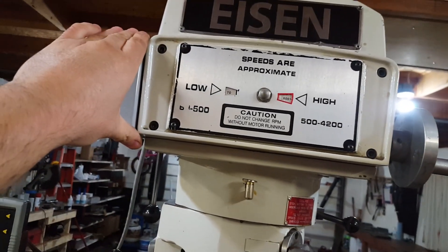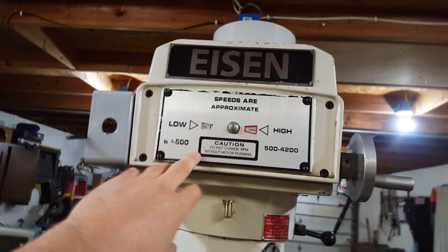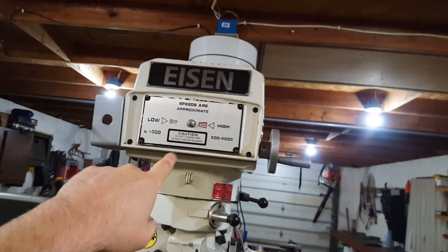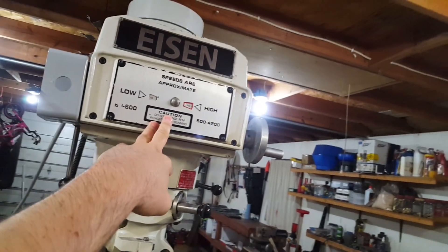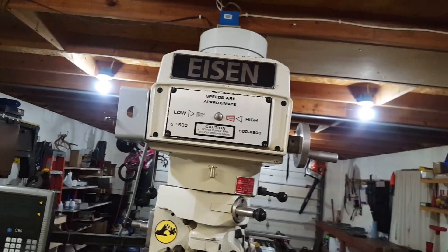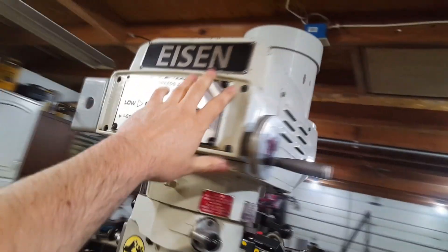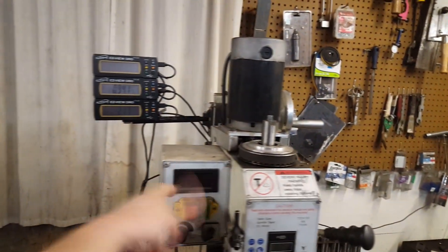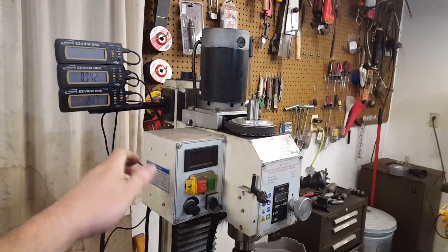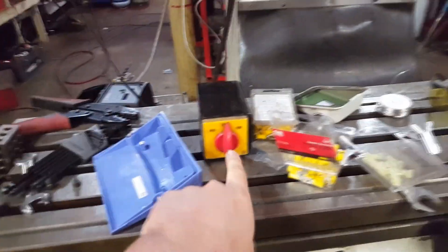The gear ratio goes really, really high and at the lowest RPMs I have a stupid amount of torque, and I want to keep that. I do not want to turn the motor down — I want to adjust the transmission to get my low speeds. If you just have a single-speed machine, then you'll want to actually adjust the motor rather than the gear ratios, but for my setup I want to use the transmission.